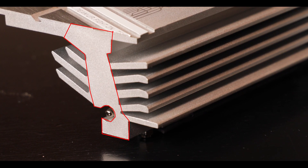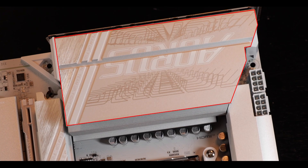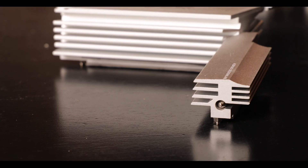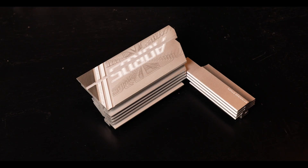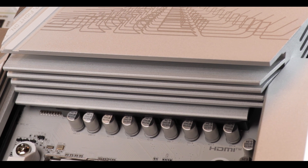What makes even less sense is that the cooling blocks are so much better than what we saw last year when the VRM was more powerful. This year, the heat blocks are amazing. The main block's supporting wall is tall and massive, with several long winglets to extend the radiating surface, topped by a large area radiating roof. The side block is dense and shows the same winglet design. Both are linked by an 8mm wide heat pipe for homogeneous heat spread, and both blocks provide direct thermal-padded contact to both chokes and power stages. Basically, we have an upgraded cooling solution for a downgraded VRM.